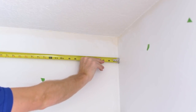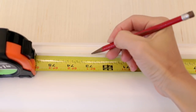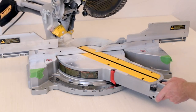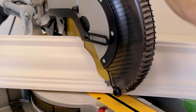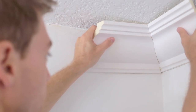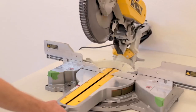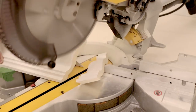When you reach the corner, you'll want to measure to your longest point against the wall. Measure carefully to avoid cutting too short, as there's not much room for error here. For your left side corner piece, the cutting process is the same as the first time, except you move the saw 45 degrees to the right and cut on the right side. This cut plus your first cut will give you a perfect 90-degree angle. Most walls are not exactly 90 degrees, so you may need to use an angle finder if yours are really off, but spackle and caulk can go a long way to hide imperfections.